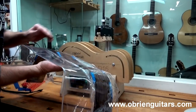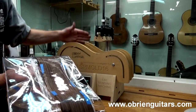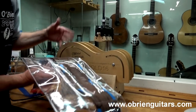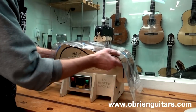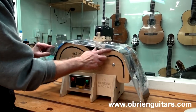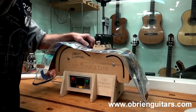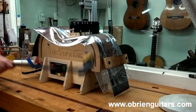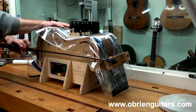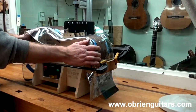With the side in the vacuum bag and the seal made, you need to put it over some type of shape to maintain the curve. I'm reusing my LMI bender that I used to bend the outside veneer. You could also make a male-female form or a camelback form with clamps. I'll place a piece of spring steel in there underneath for a little more support, then lower the waist and take it home. It doesn't take a lot of pressure — just something to hold it down and make it take its shape. I'll place some scrap blocks of wood and bring my clamps over the top to help maintain the shape.